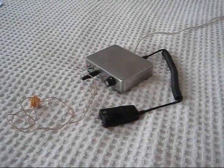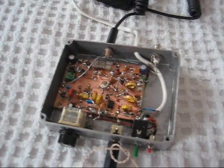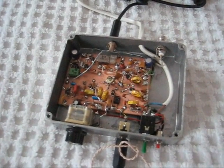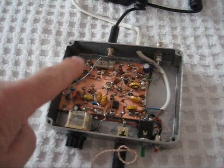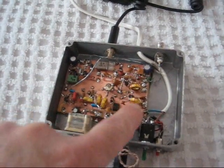I'll take the box lid off and you can see inside the construction. So here we are looking inside the box. The transmitter is a third overtone oscillator on 50 MHz into a buffer and a PA. The PA is series modulated with a small modulation stage here — the crystal, the multipliers, the PA, and the antenna filter here.